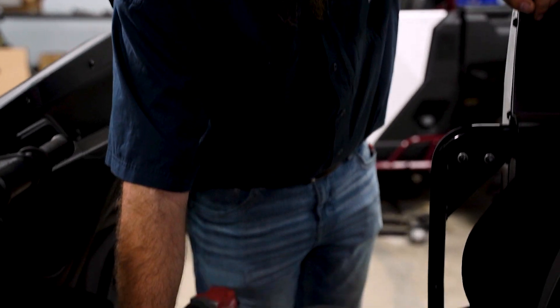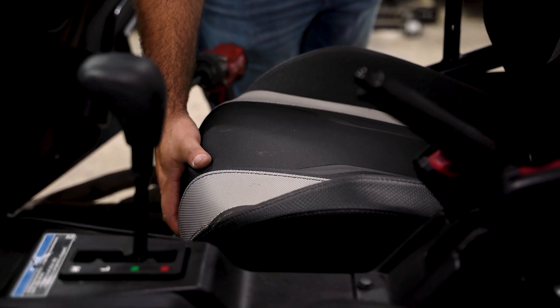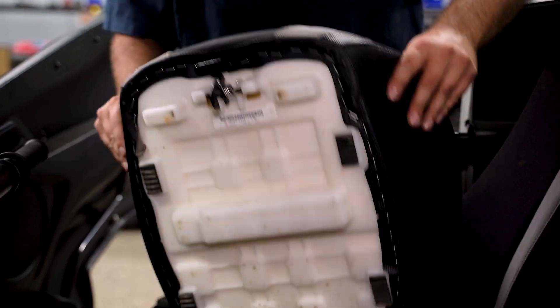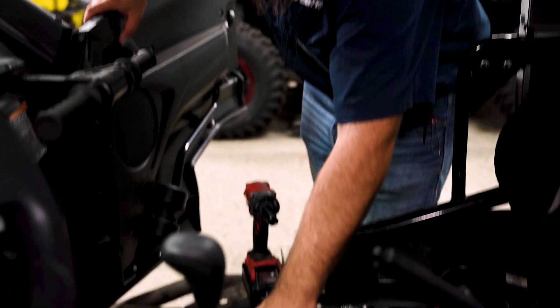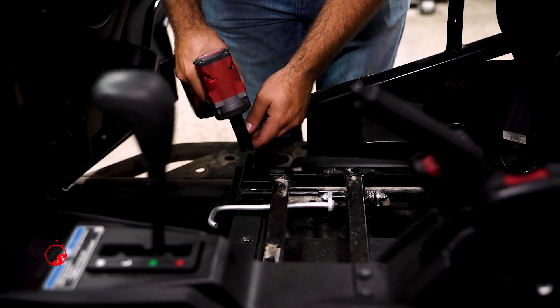The first thing we're going to do is go ahead and remove our seat cushion. If you reach around to the front of the cushion, you're going to feel a latch. Lift directly up on that latch and remove your seat. Take our cushion and we'll set it aside. Then we're going to come right here to the front of the base and remove the two bolts securing the seat base to the frame of the machine.